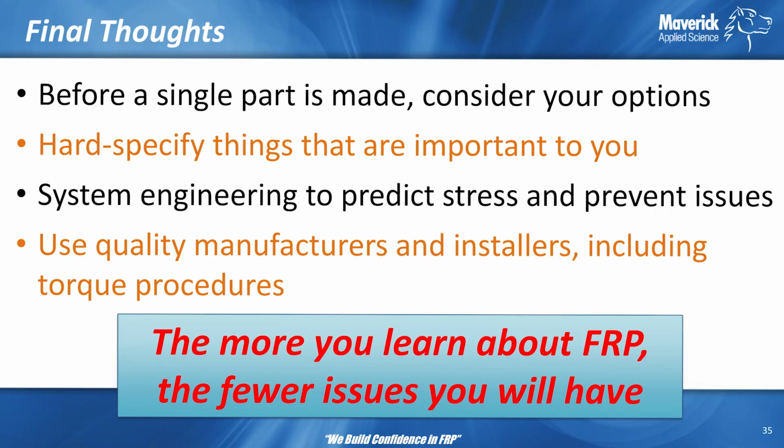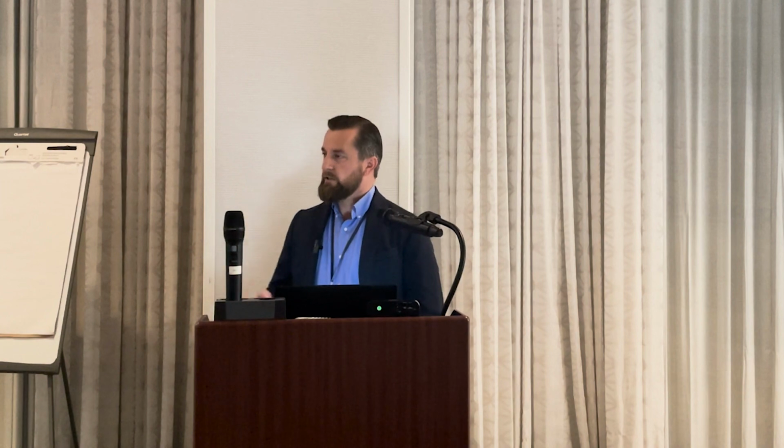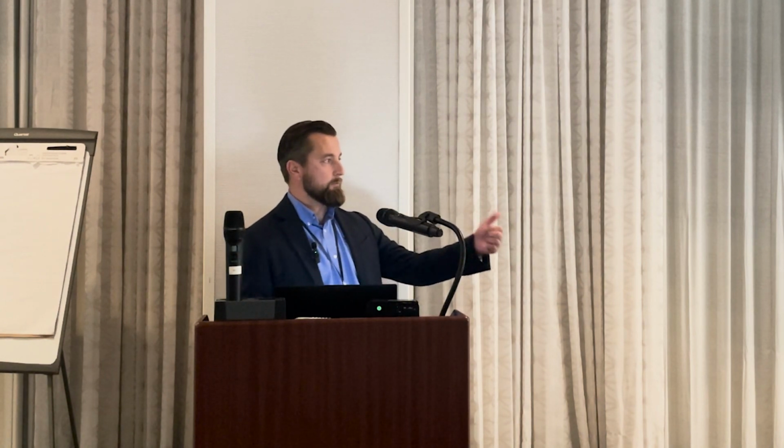So final thoughts, I mean, hopefully I've hammered it home. Before a single part is made, you have a lot of decisions to make. Consider your options on joints. Make sure you have good specs. Are you able to move any joints around to avoid some of the hot spots in your system? What flange style do you want to use? Can you use lap joints anywhere, or are you forced to use full face? Do gasket selection. Calculate your torque range.